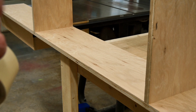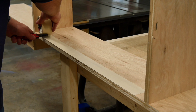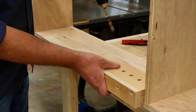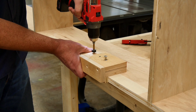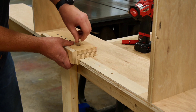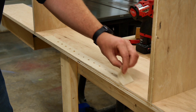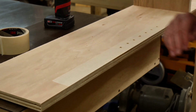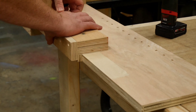Next, I got started on drilling all the holes for the shelf pegs. I put down a strip of masking tape and then used my homemade shelf peg jig to drill a series of holes wherever I wanted them — in this case, a dozen holes near the edge of each cavity. As you can see, I just drilled a couple holes and then used a quarter-twenty bolt to secure the jig into place while I drilled the rest of them. The tape helped to combat any excessive chip out from the drill bit. Once the first series of holes was done, I just repeated that same process like 9,000 more times until all of them were done.